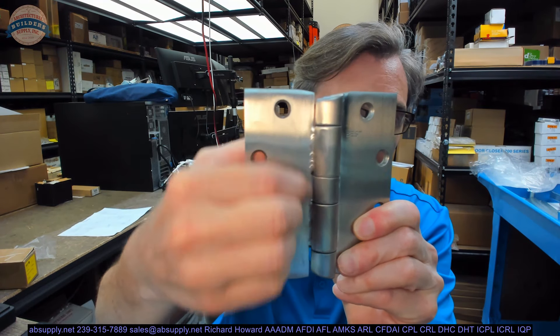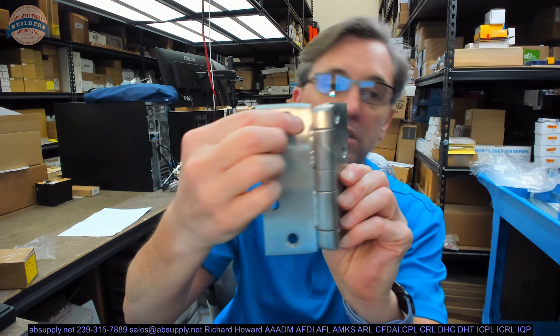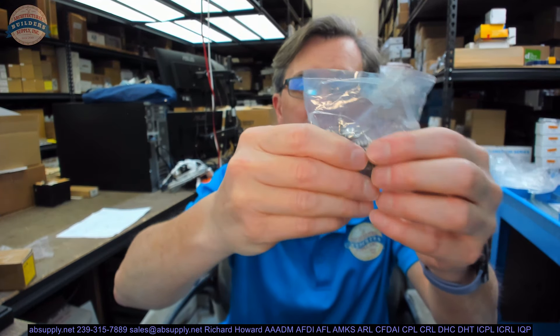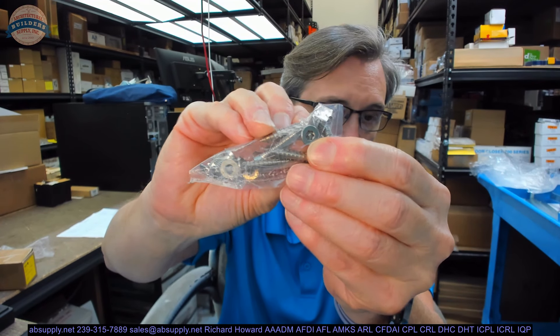The welded feature here — I have actually seen hinges so stressed that the knuckles started to open up from being hyper-extended or hyper-damaged. That's really not going to be the case with this hinge because it's been welded closed. All of these features on this hinge serve to drive the cost. To prove how intended for the security market this is, here's your fastener package. All of these screws — both machine screws and wood screws — are pin torx. Probably T25, but don't quote me on that.